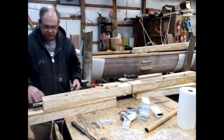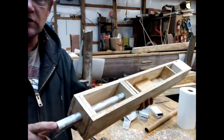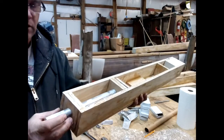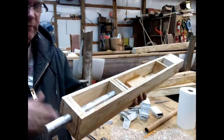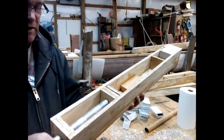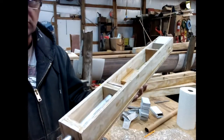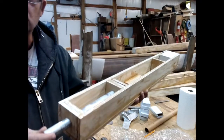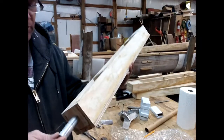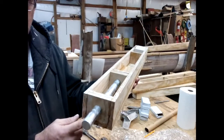All right, I'm gonna show you guys the inside of these guys here. This here on the end is an aluminum pin. The amas actually have a hole in the oak, fiberglass reinforced oak setup that straps down. And this pin, this is a real stressful point here. Gary actually recommends that you use hardwood for this. I figured aluminum is a little bit better than hardwood. And these big 1 inch diameter shafts are not very expensive, so I went ahead and got those. I CNC'd these holes directly in the center here.